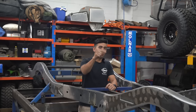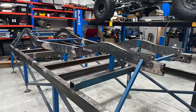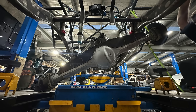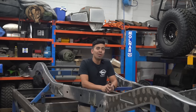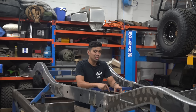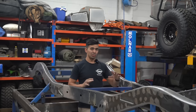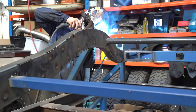We've also been doing some modifications to the front of the chassis — relatively minor in comparison to the rear. We're shortening the rails a little bit, bracing them to strengthen them, and also raising them for a better approach angle. We've got the LCS shop truck beside us here, which has progressed much further, and we've been able to prove our design by cycling the suspension on that one before jumping into this chassis. So we're pretty confident in the overall suspension design. I hope I explained it well — let me know if you'd like a more in-depth whiteboard explanation or if the high-level overview works for you.